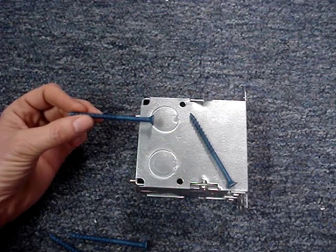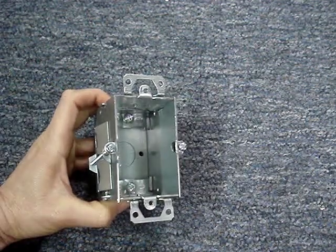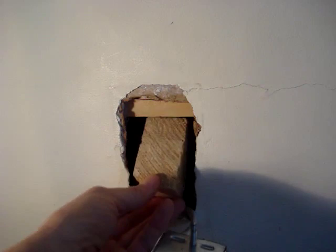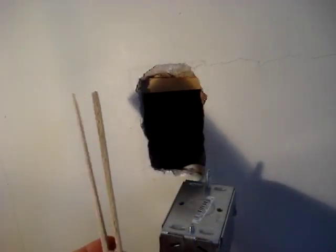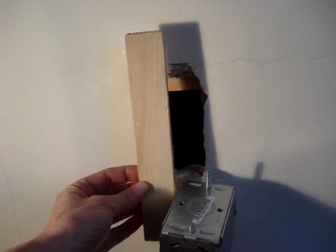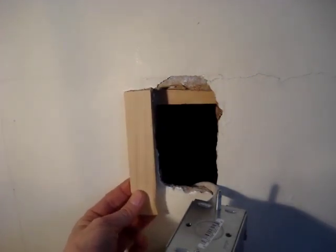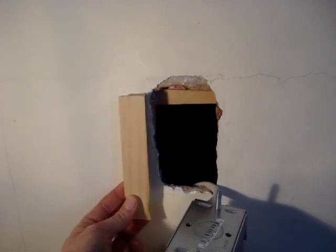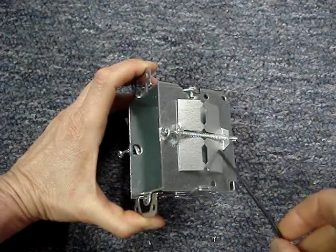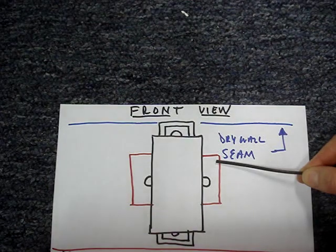A friendlier option would be to mount the box to the block wall with some tapcons. I'll go with a box that uses a different type of fastener. I'll use silicone to tack a block of wood in this location, then use a pair of wedges to take up any space between the block of wood and the back of the drywall. For additional support on the sides of the opening, I'll silicone strips of wood on the back of the drywall at both locations. When the screw is turned, it compresses a piece of metal and it folds to form a wing along the back of the drywall.